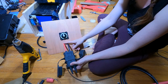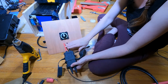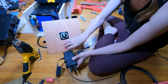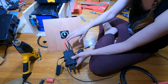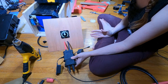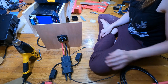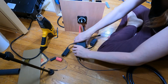Okay, so I had to leave a fair bit of a length. I couldn't really go much less than this and still be able to crimp them with the boot back, but that's okay. It's not the worst thing in the world to have a little bit of flop. I was hoping originally this would be set further back, and when I do the real face, I'm going to see if I can find some grommets that can snap in, in which case I can crimp these without being through the face and then feed them through the face, snap the grommet into place and then clip them in, and I won't have to have quite so much. But really, even if I have to leave this much, it's not the end of the world. However I decide to grommet these to keep the water out. I like it. I like it a lot. That makes me very happy.